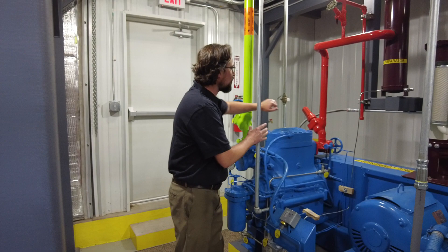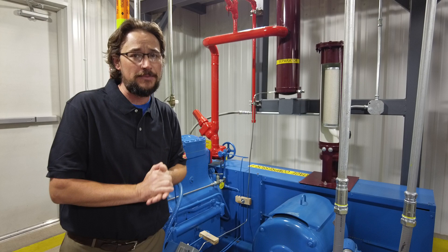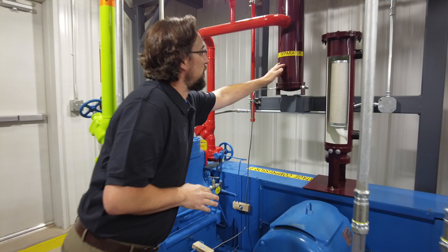This is our pump-out machine for the technician engine room. Here is our main suction. We've got our discharge, and when you follow the discharge coming out, this is our vertical oil separator. Most people know that oil separation in the industrial ammonia world in the past was probably just a tank, maybe some mesh in it — but Temprite is changing the game. They've got oil separators for ammonia, HVAC, F-gases, and CO2.